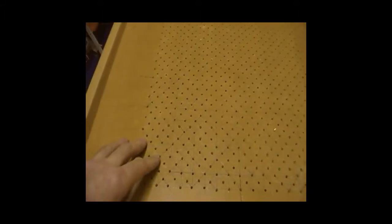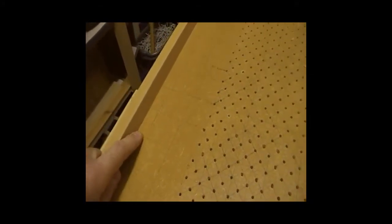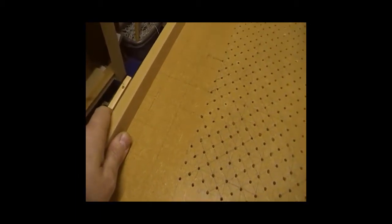Next stage is literally to stick some foam around the edge to make a seal, to make a bond down there, and then drill a hole around here to connect up to the Hoover that will then suck the chamber out. Now although this looks quite sturdy, the idea is so the frames will fit in as well. I've left 2cm or 20mm gap down here, and I intend to use 2 9mm plates together that will just fit into here to create the vacuum form.